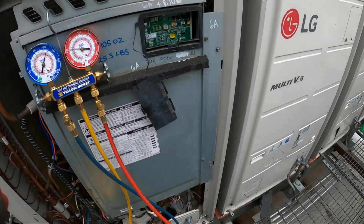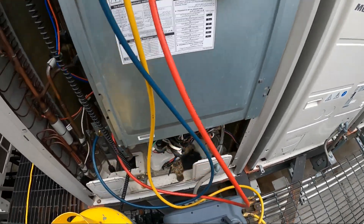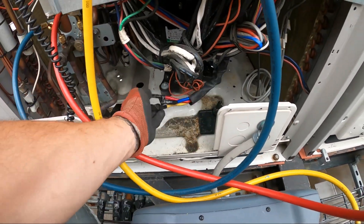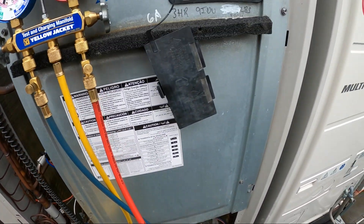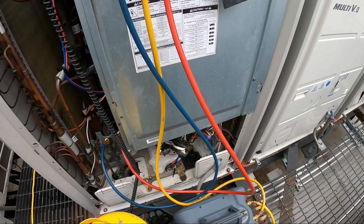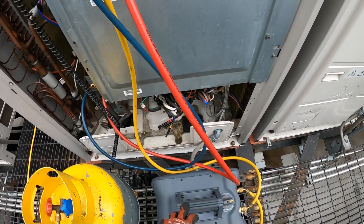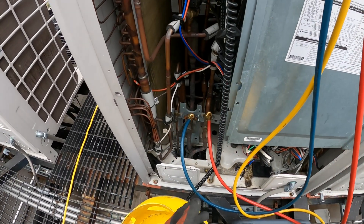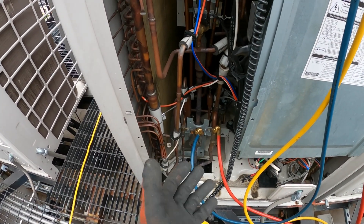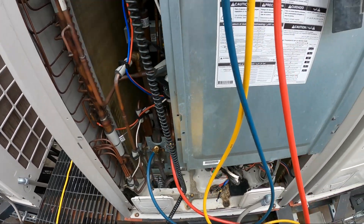What we're going to do is turn the power on — right now we have the power off. Here are the compressor wires. We're going to be here all day changing this thing and we're even going to pull an overnight vacuum. You also want to recover the proper amount of refrigerant because you might be lighting a torch and there's still gas in the lines — you don't want that happening.